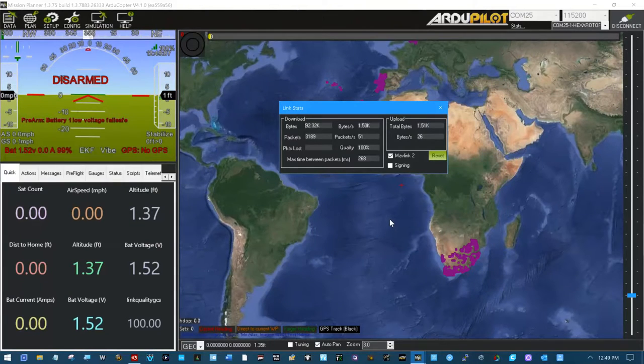That's a straight USB connection - that's as fast as the MAVLink data can go between the platform and whatever computer you're using. I just use a simple Toshiba computer in the field. At one point the telemetry radios just plug right straight into the USB - there was no cable or anything, no mouse needed. Just put the Toshiba computer somewhere, turn it on, connect, and you're done. I do a lot of extra things like screen recording Mission Planner on my notebook, but it's part of my checklist anyway.